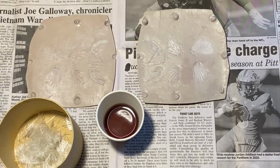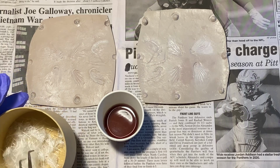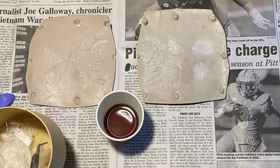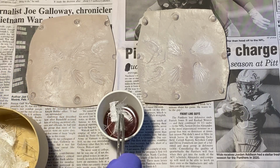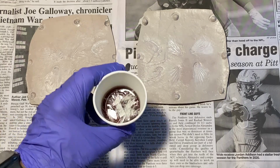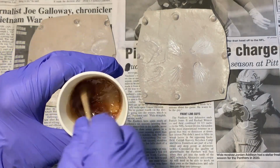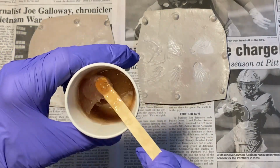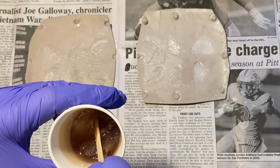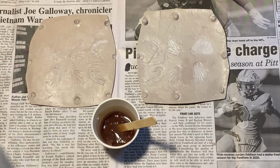So I'm going to take my fiberglass resin, 1/2 ounce, take some chop, thicken that up. That'll give me good support on the fins. It'll give me good thickness. I'm going to mix that up really well, and then I'm going to add my MEKP. You want to make sure you mix that completely, get it off the sides.